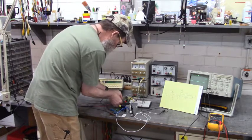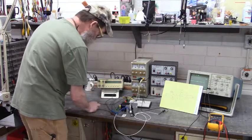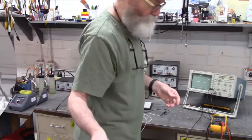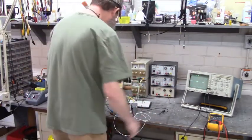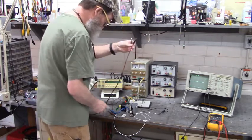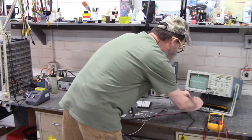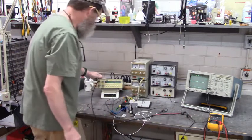Let's get disconnected from our transistor circuit that converts a 5 volt square wave to a 24 volt square wave. Let's hook up our oscilloscope and we'll look at the waveforms - we'll look at the output of this Victor function generator.